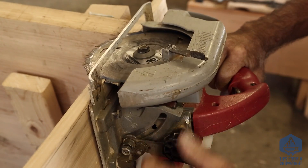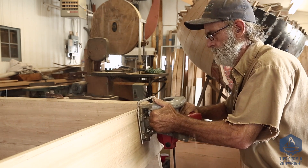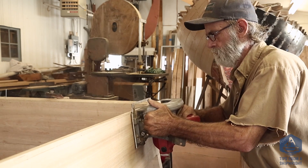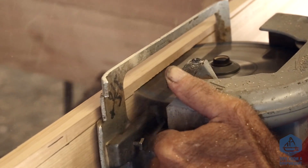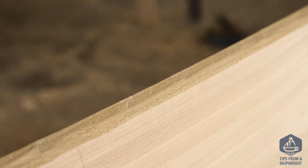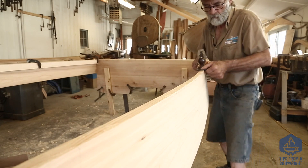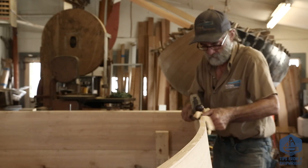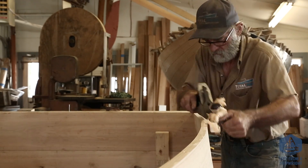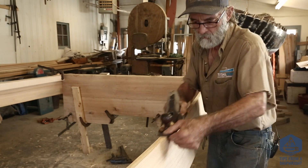We're going to take a pencil, draw a line along the top of the batten, then remove the batten. Then we'll take a circular saw and cut along that line just barely above it — it'll be a little lumpy because it's hard to follow the line perfectly freehand on this pretty soft wood. Then we're going to take a plane, smooth out the lumps using the lower spots the saw left as a guide for our height, without changing the shape — just smoothing it up a little bit.